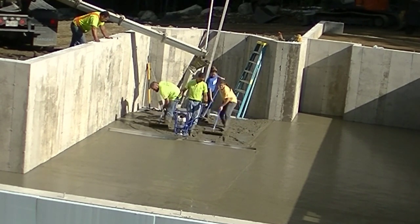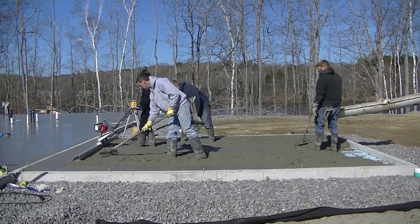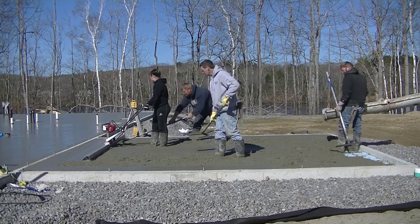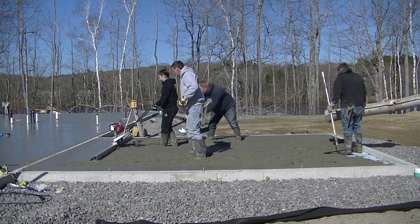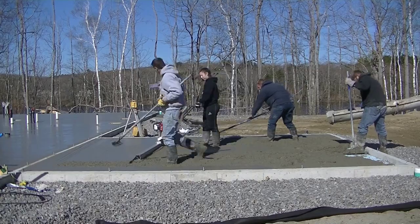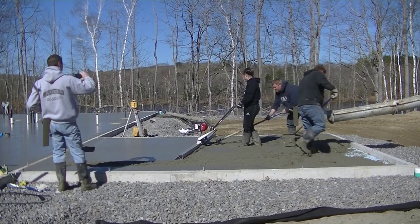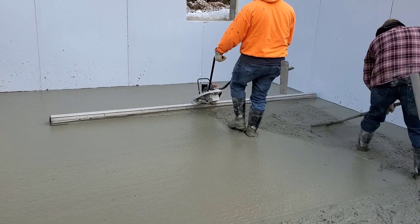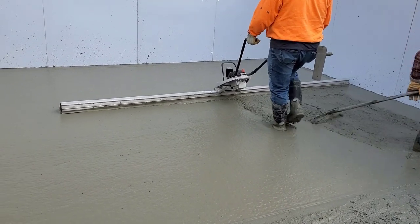The people doing most of the work are really the rakers. The guys or gals running the power screed are basically just watching the ends. I taught my daughter how to use this — the Screed Demon — she'd been raking behind it long enough and finally I said 'here, you try it' and she did just fine. It's just a matter of giving it some throttle, watching your ends, making sure you're not digging in, putting some light pressure back on it, and letting your rakers do the rest of the work. She ran it really well and has been running it ever since.